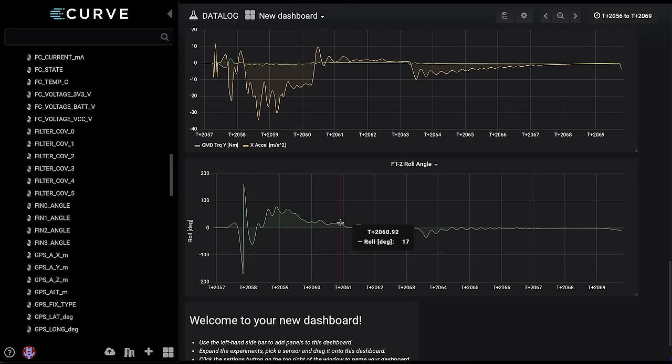The second thing I'm noticing is that after the second pitch setpoint change, the rocket changes its attitude much quicker. The initial pull-up after changing the setpoint back down to zero gets us pretty close to zero in flight, but only to about eight degrees in the simulation. So there's something else that's wrong — it could be that the mass moment of inertia is incorrect, or that the rocket in flight is actually less stable than the model suggests. I'll continue to tweak this model, comparing model data to flight data each flight, so hopefully I can get a really accurate simulation that lets me test the rocket on the ground without spending time and money burning rocket motors.